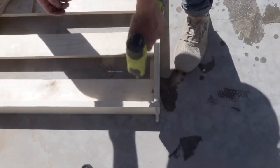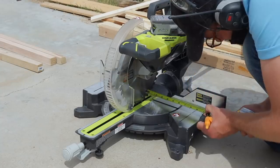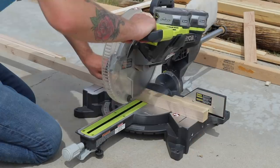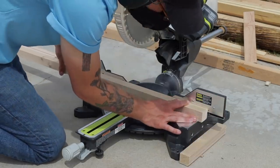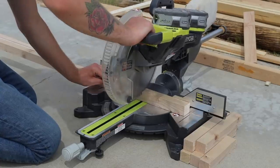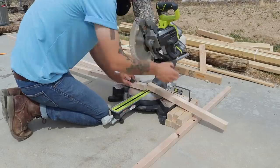With the platform finished, it was time to move on to making the base, which is built completely out of 2x2s. I just set up some marks on my miter saw and was able to cut all of my pieces to length right away. Sometimes I need to make repeatable cuts that are too short for a stop block, so making this little mark is a quick way to get that repeatability. I can come back with some mineral spirits or acetone and clean up the miter saw later.